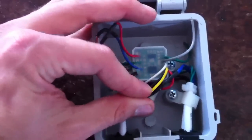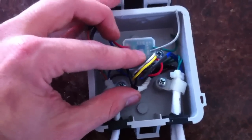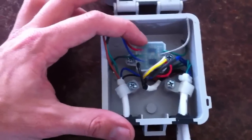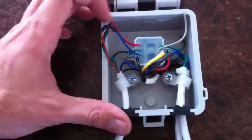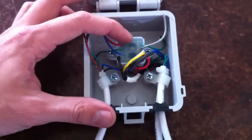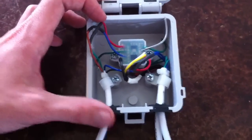As you can see it looks like a rat's nest of wires like the other one. But you have two wires for positive and ground 12-volt input — and actually these things will work anywhere from 8 to 24 volt. Then you have two wires coming out: that's your clock and your data wires. I'm joining the power wires just directly across, so I'm not running any power through the protocol converter.